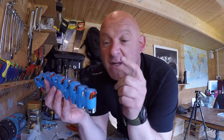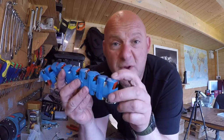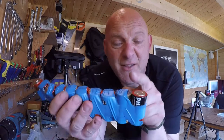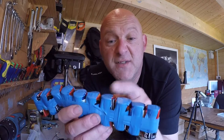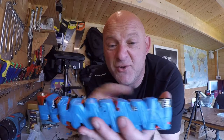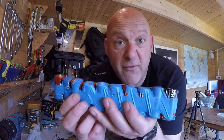So how do you do that? Well you basically have to use lots of bits of wire and lots of insulation tape. You take the positive from one battery and hook it up to the negative from the next battery, flip it over, take that positive, hook it over to the negative of that battery, positive to negative, all the way along until you have one positive from one battery and one negative from another battery.